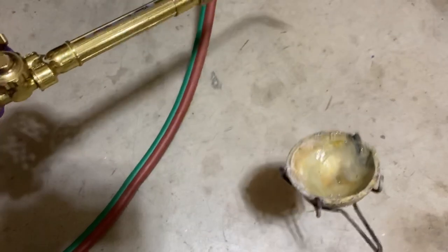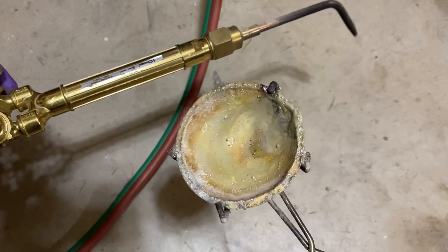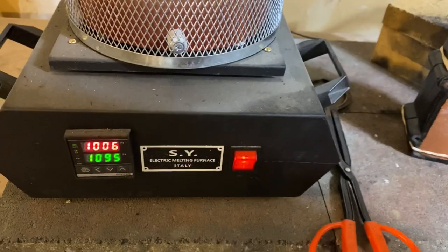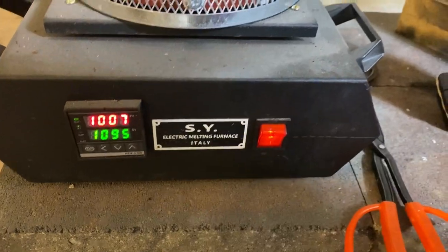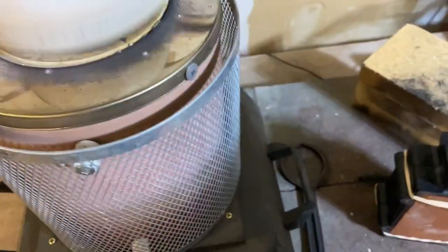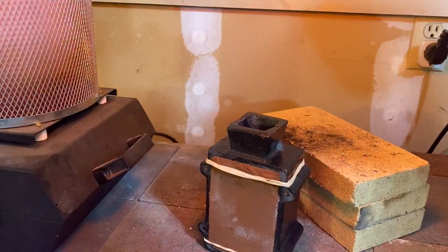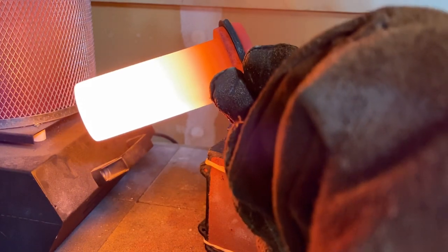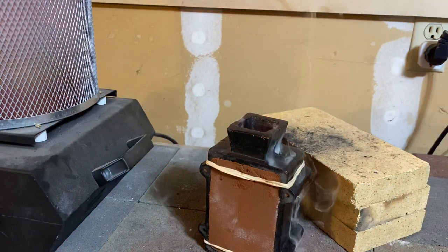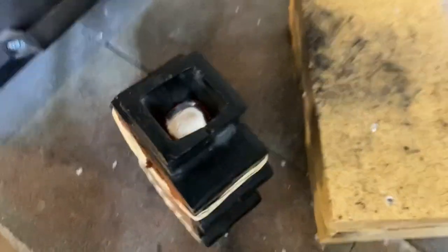As far as melting goes, you can use a setup like my oxygen acetylene torch with a whip — just melt the silver and pour it into the mold. But an easier strategy is using my furnace. We're going all the way up to 1095 degrees Celsius, which is about 2000 Fahrenheit. You can see the silver is already starting to melt down nicely. Once it reaches full temperature, we pour it in. For the pouring process, you just want to make sure you pour it really fast. It's okay to pour a little bit too much because we're going to cut off the top anyway. I filled it not all the way to capacity, but a little bit overflow.